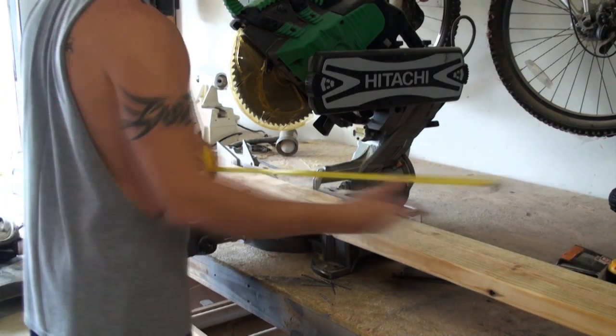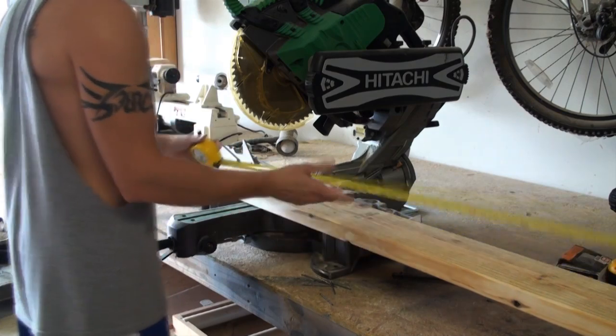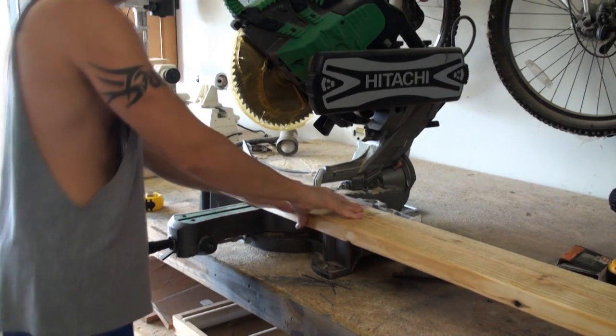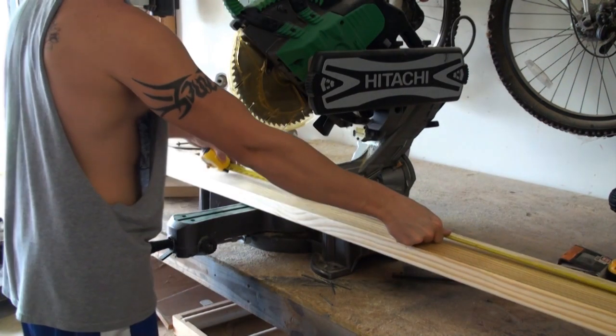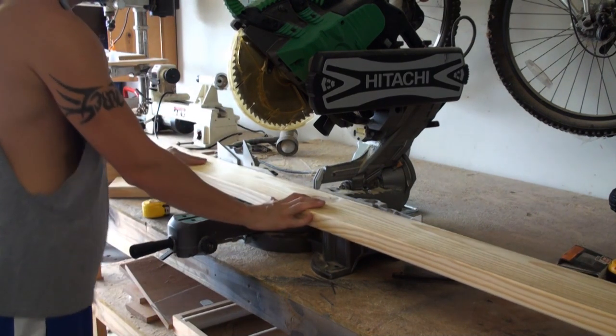What I'm doing right now is just giving a rough cut. I need about 32 inches or so, so I'm going to cut it about 34 inches just to get the pieces in a manageable size. I'm going to take them through the table saw in a clip here in a minute and square up the edges, give me a nice square piece of lumber to work with.